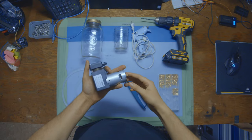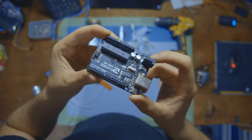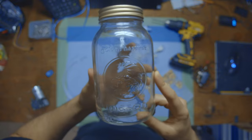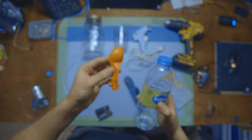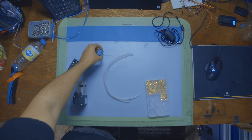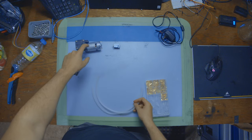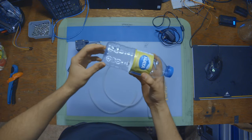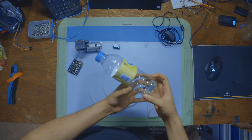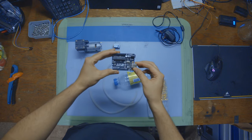For the demo, we're going to need a couple of things: the vacuum pump, some tubing, an electronic relay, a 12-volt power supply, a microcontroller — we're going with an Arduino — and if you want to make your life easier, some crimp connectors, some glue, and a glass container for later when we make our vacuum chamber. A balloon or an empty water bottle would also be good. We're going to connect our power supply to an outlet, then to a relay, and run tubes on the in and out of the vacuum pump — one of those tubes into this water bottle — so that it sucks all the air from inside the bottle out.